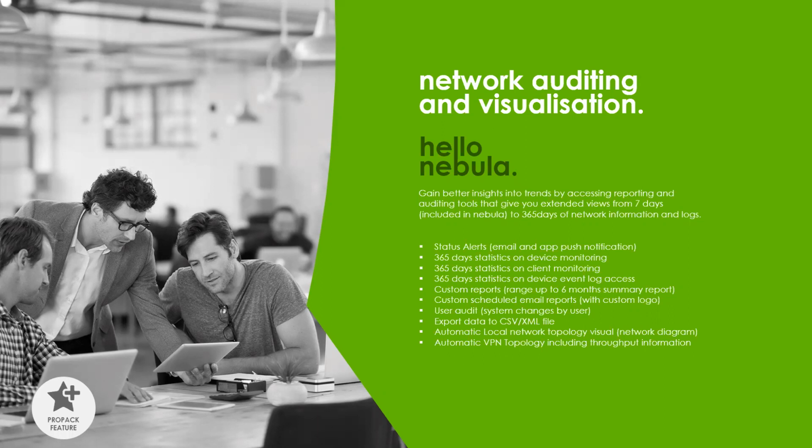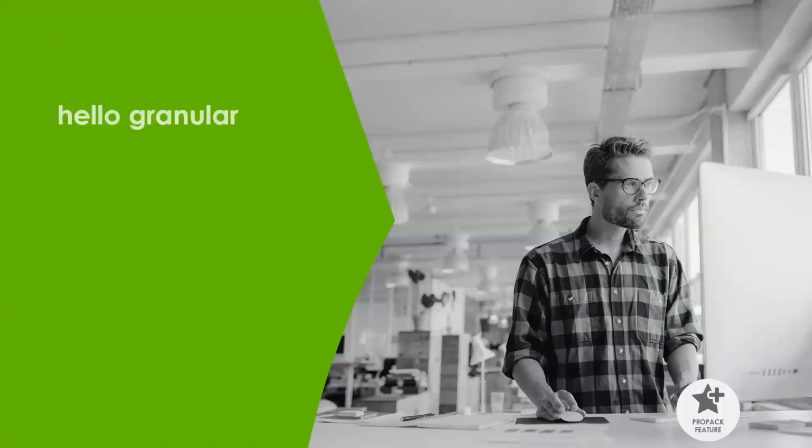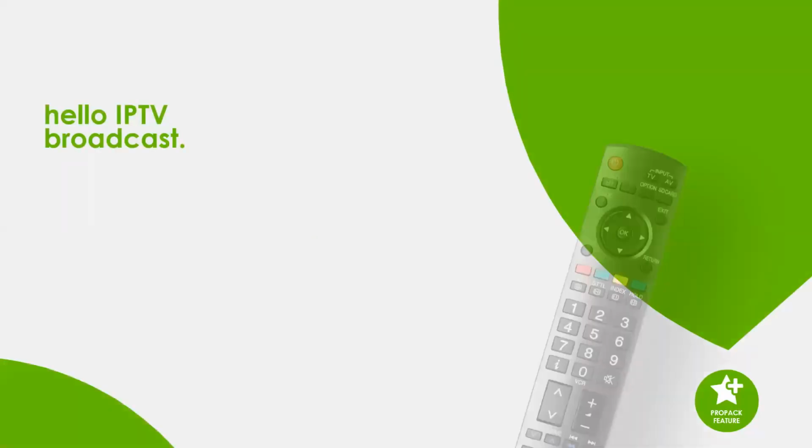It gives you the ability to export a lot of data, do more backups, and some other fun stuff, such as an automatic network topology view. We'll generate for you a view of your network: which APs are plugged into which switches, which are plugged into which gateway ports, et cetera. We'll generate that automatically for you with Nebula Professional Pack. We give you more granular bandwidth control on the switches than you would have without the Pro Pack.